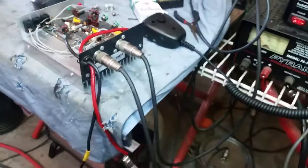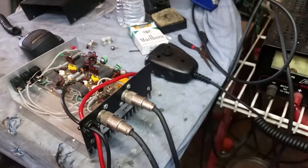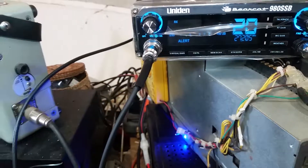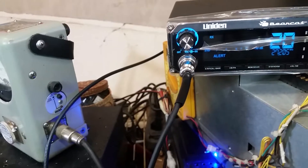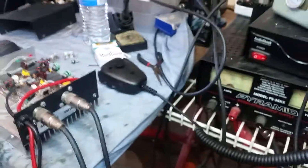With my radio I'm dead keying 1 watt and swinging up to 4 watts RMS, so I've got a low dead key swinging up to 100 Bird — that's what you want. This radio on sideband was doing about 12-13 watts peak on my Bird meter before; after turning the modulation up it's doing about 15-16 watts peak — a little improvement, but it's only making the amplifier do about 200 watts peak. Let me go ahead and hook that up now and show you the sideband delay is working too.